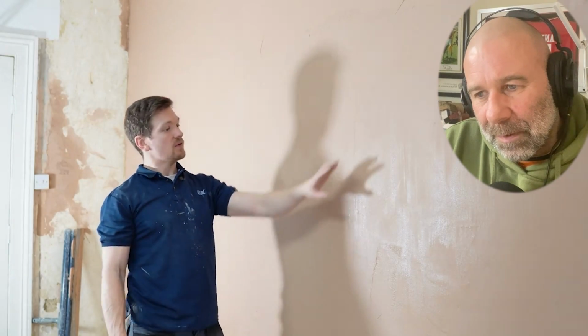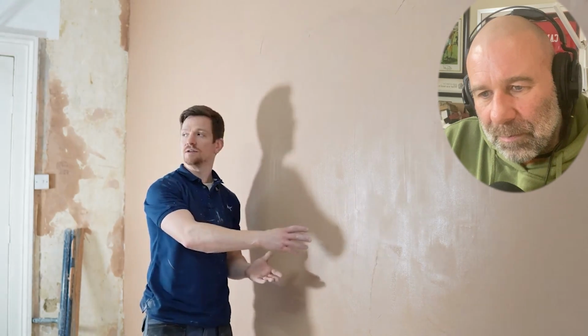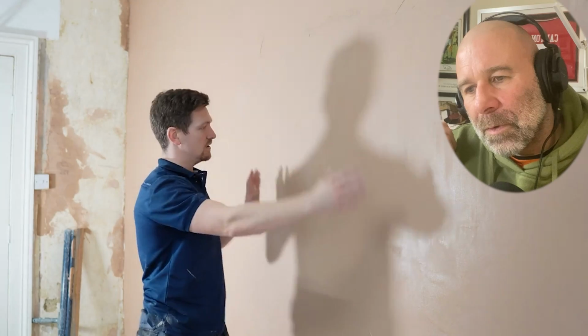Yeah, this whole area is good. You've got enough thickness on there. It's spread nicely. You've got a few areas, but what we're looking at there is because you put enough thickness on, where I kept saying don't worry about having too much on, you've got nice, consistent two coats, where a lot of beginners will put it on too thin, and it'll be very patchy. You'll see back to the existing plaster, or you can see the first coat where the second coat wasn't put on right. Because you've got a consistent, nice thickness throughout, it looks like one uniform colour, which now we can work on. So that's amazing, that's proper, really good.